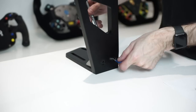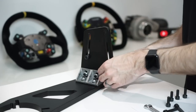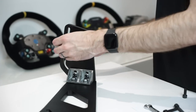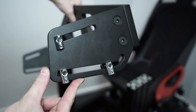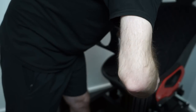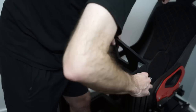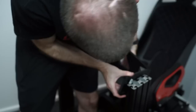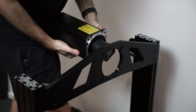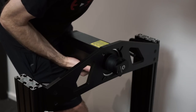Note that the flat wheel plate that comes with the P1X by default doesn't require this assembly — it just bolts straight down to the chassis. The optional Fanatec wheel plate also requires some assembly. The easiest way I found to get everything bolted down and lined up was to spin it around on the table, line it up on each side, and tighten everything down. I pre-installed three M8 T-nuts on each side — six in total — just for preparation. It slots into the profile two on the bottom and one on the top. Make sure it's nice and square and get everything tightened down.